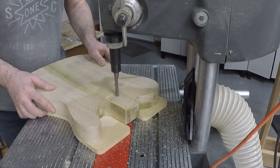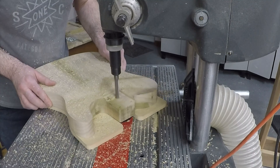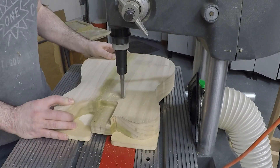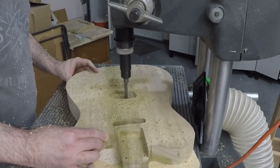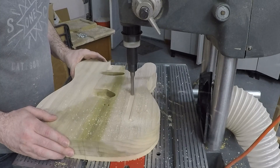This is my first use of my new infinity bit and I'm pretty happy with how it went — it gave a pretty nice smooth surface. I'm going to mark the center lines, which will allow me to easily attach the second template so I can route out the neck pocket, pickup pockets, and control cavity. This is the pin router setup and I'm using a half-inch upcut bit. Then I start in on the pickup cavities and finally the control cavity.